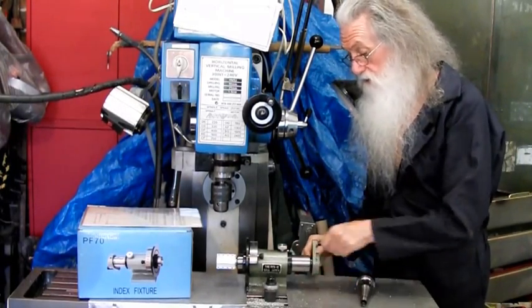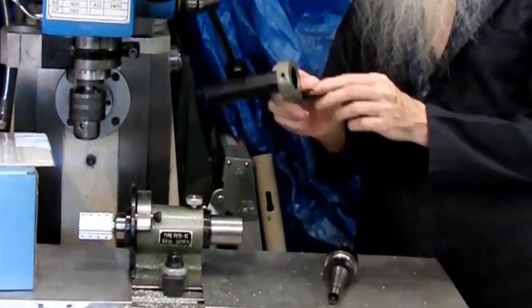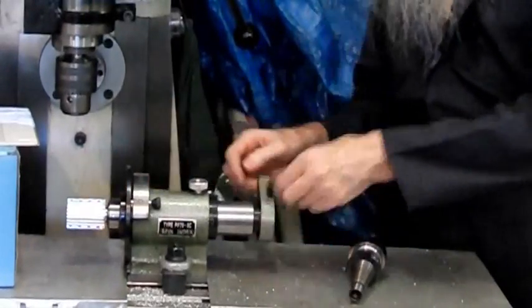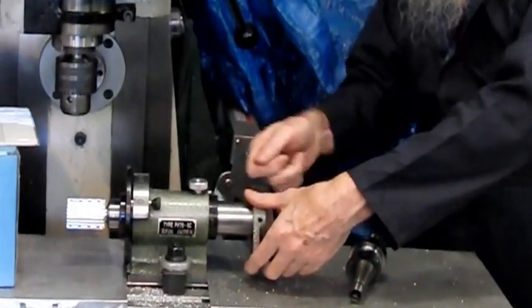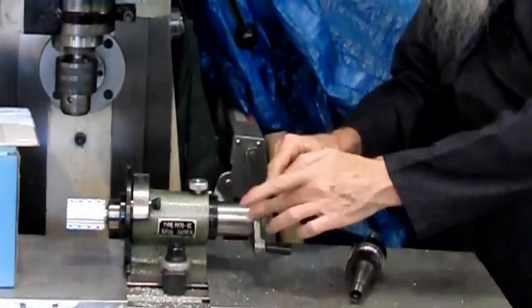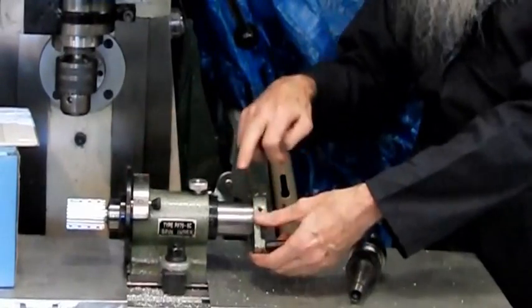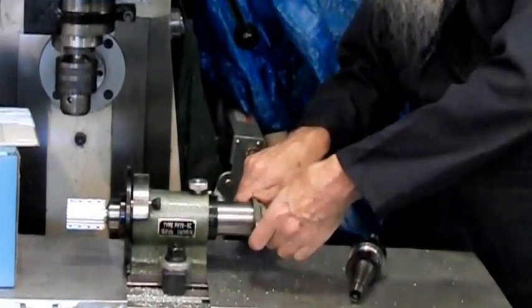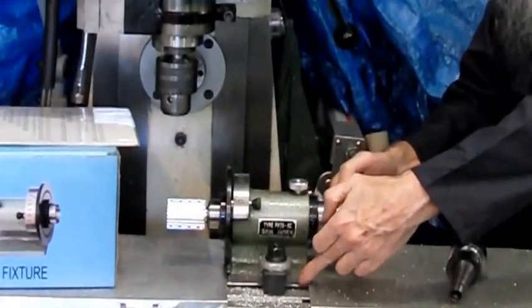Also, there is this screw adjuster, tightener. That's just a threaded shaft that fits on the collar. But again, these are loose. You have to tighten the chuck. Then when you come up, you'll find that on the screws you can't get a good enough purchase. You tighten that and this is spinning on the shaft, not tightening the nut. So spot those through and then they'll be secure. This always seems to come off, so make sure it's tight.